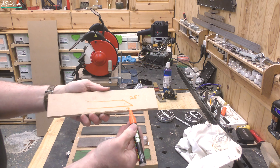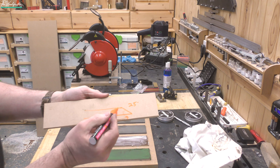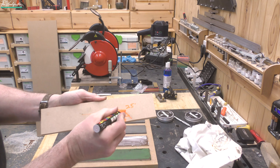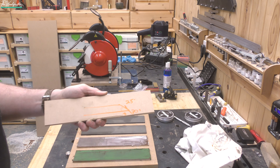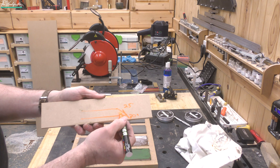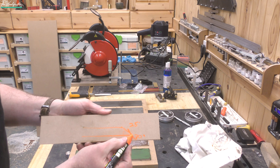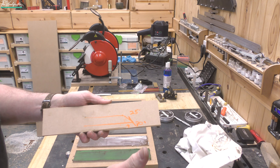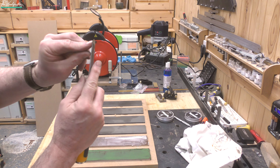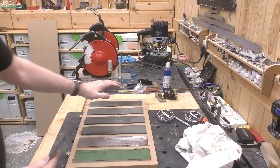Our blade is now flat on the bottom and has a 25-degree bevel. What I want to do now is put a 30-degree bevel on it. What we don't do is regrind the entire surface — that would be stupid. Instead I just take a 30-degree bevel right across the very end — that's known as the secondary bevel. Primary bevel at 25, flatten the back, then put a secondary bevel at 30 degrees across the end. That gives me quite a lot of meat behind that slope, and an intercept of 30 degrees at the flat back and that bevel. All I've got to do is work the very very tip of the chisel. Going forward, whenever I sharpen this chisel, all I care about is that very very tip. There's not a lot of metal there — at that intersection of the flat back and the 25-degree bevel, only a very small amount of metal to remove to give us a 30-degree bevel that we can polish up through the grits.